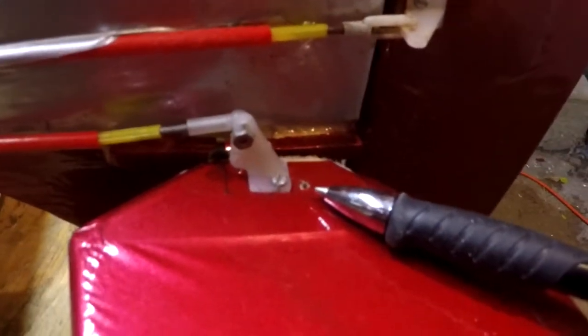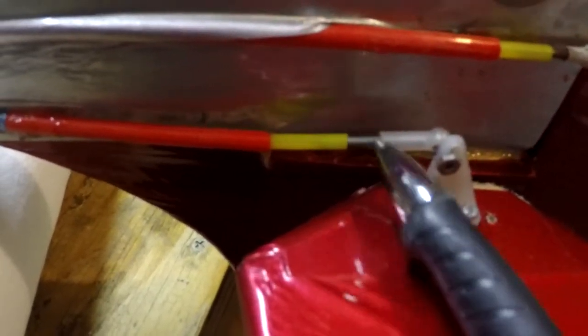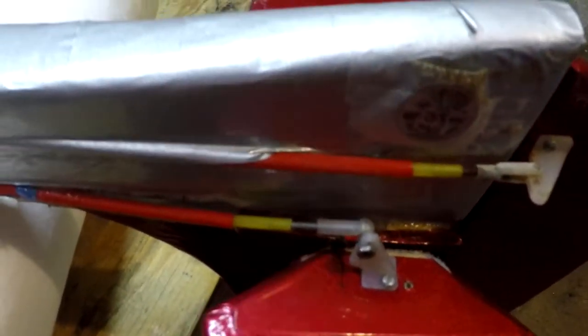Okay, now I said it failed when it was all the way back from one full pad back, but partly the reason it failed, and what I'm telling you is that this needs to be as short as possible. That's what I wrote in that, and I actually lengthened that wire itself to get back here, so this part of the wire was really stiff. And let me show you why. It needs to be flexible. This needs to be as close to that as possible with that wire as short as possible. I'm even going to shorten that one. I can shorten it by that much, and I'm going to.